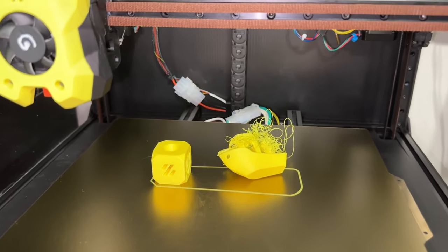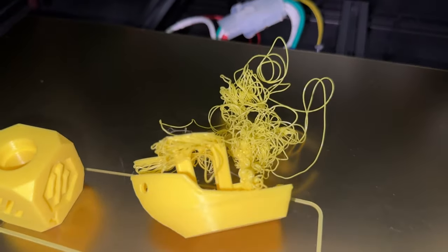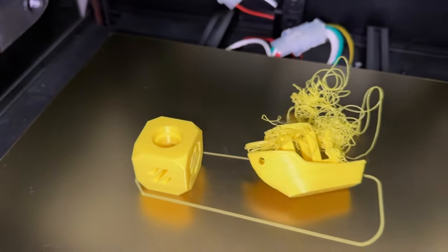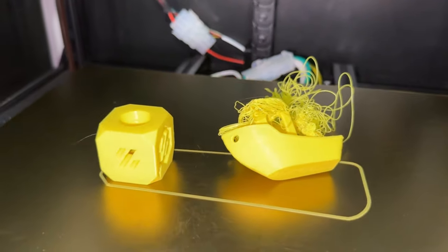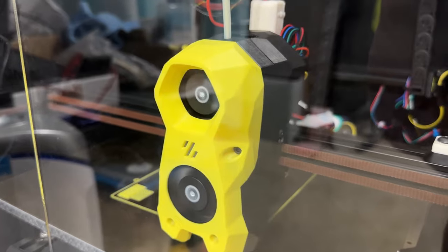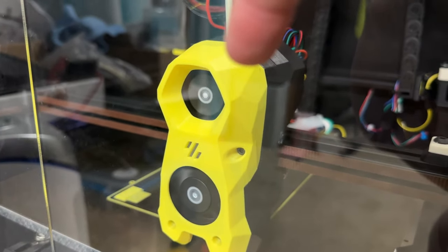Sort of. Using the SuperSlicer generic ABS profile, my Benchy failed at the top overhang and bridge section. From what I notice, this profile does not have cooling fans enabled. If you choose the built-in KVP ABS profile, the cooling fan is enabled. So I tried that next.